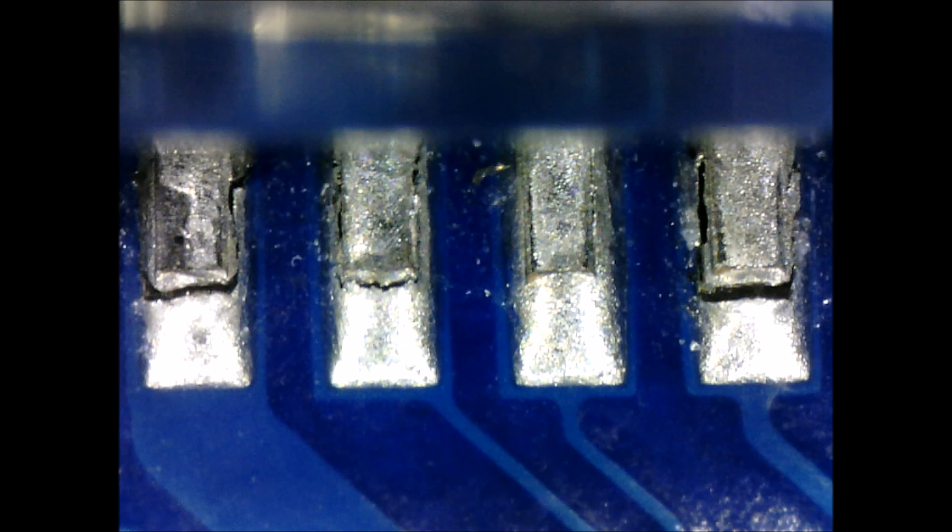Fixing it is fairly simple since the pads themselves are not damaged. All you have to do is heat the board up and melt the solder. I usually put a little bit of extra solder on there just to make sure it has a good connection, and then once it reconnects those pins to the pads on the board you're pretty much good to go.